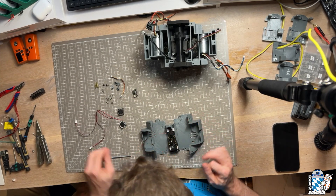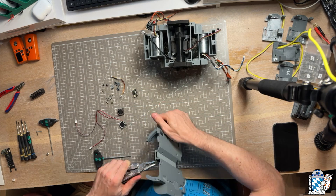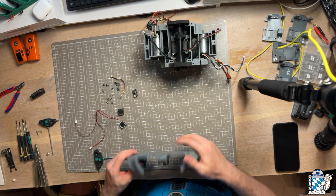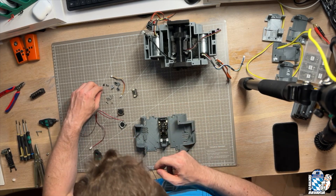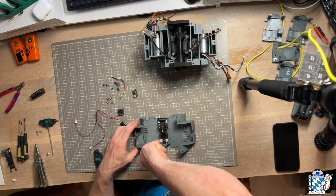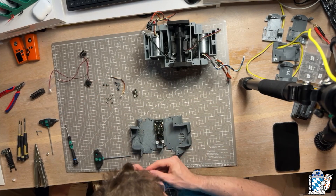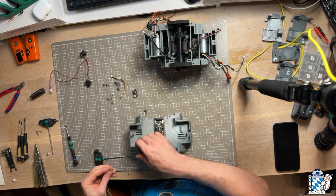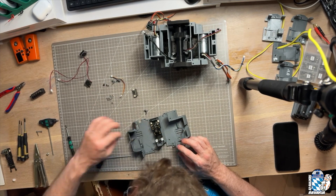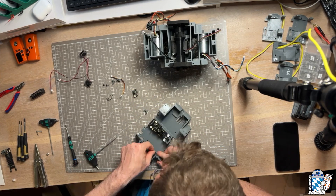Once these are tapped, we can add the power distribution board and hold it in place with the brass standoffs. We didn't have a hex wrench for them either, so we put them in with pliers. Then add the remaining screws — these just self-tap into the plastic. Next up are the battery clips. These get fixed with M3 countersunk bolts — push through from the bottom. Then add the clips on the top so the raised part faces towards the power board, and fix them with nuts from the top. You can use Loctite to make sure these don't come loose.